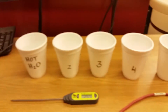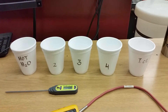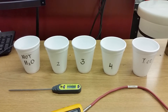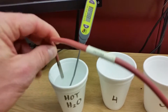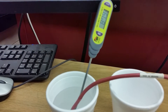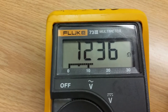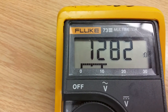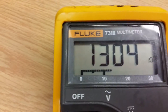I've set up a number of different styrofoam cups — hot water, then two, three, four, and finally ice water — so we should see a gradual temperature increase. I've placed the thermometer into the hot water and then placed the RTD in there as well. The temperature has gone up to about 88 degrees and you can see the resistance value on the RTD going up. We'll leave it for a minute to stabilize and then check the chart to see whether it matches the temperature on the digital thermometer.